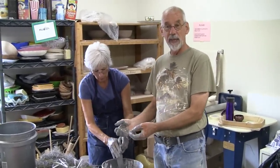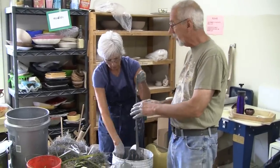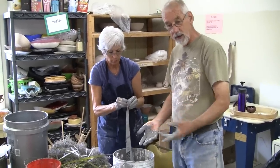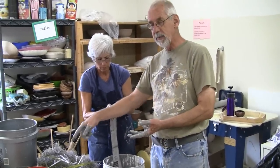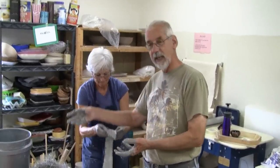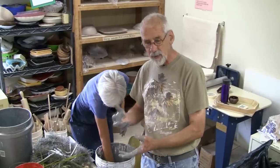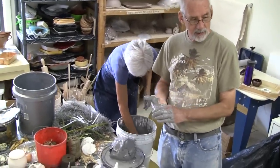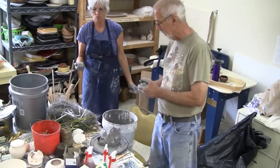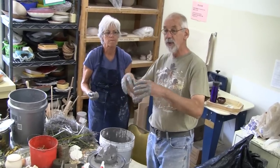If you're going to be doing this in a workshop situation, just go to the local ceramic supply store and get a small container of slip they use for pouring their molds — that's all this is basically, only I've made it myself. So sodium silicate, a little bit — I take a handful, half a cup, throw it in a container. If I think it needs more I throw a little bit more in. We've got string and rope soaked in an iron compound — iron sulfate. We use things like iron sulfate, cobalt sulfate, cobalt carbonate, and copper carbonate. You can use the oxides too, but they don't work quite as well — they are a little harder to melt and fume and to color the pots.